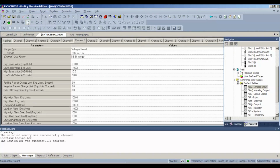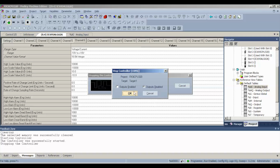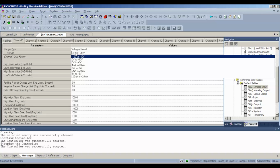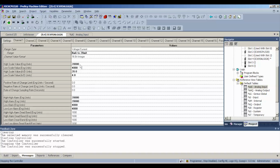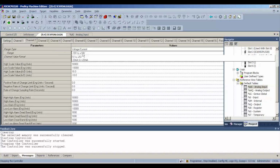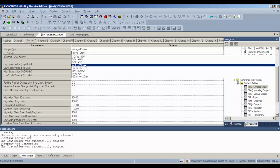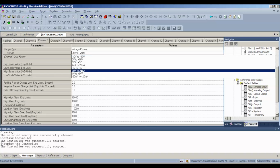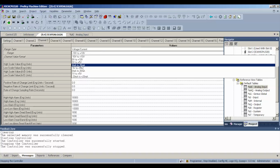that's the voltage test. And what we're going to do is stop the controller, disable the outputs, and go back through our channels, starting with channel 1. We're going to leave everything the same, except we're going to go to our range, which is the middle selection here, and select. I'm using a 4 to 20 milliamp generator, but you can use 0 to 20 milliamps if you are using something that low. Feel free to do that. The 0 to 20 milliamp is this selection right here.